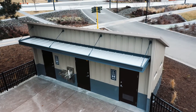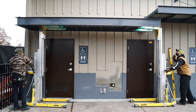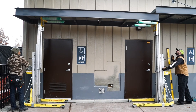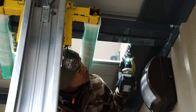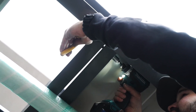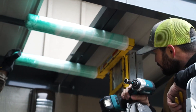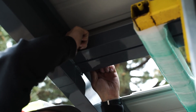Now let's mate or connect your canopies. First, raise and place your second canopy next to your already installed first canopy. You will mate canopies together by clamping canopies to align the mating holes. Once the mating holes are aligned, use the mating bolts to bring the canopies together. Once canopies are level and mating bolts are installed, you can attach the roofing panel with the provided roofing screws.